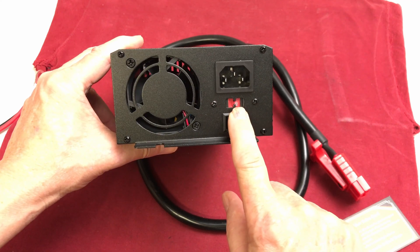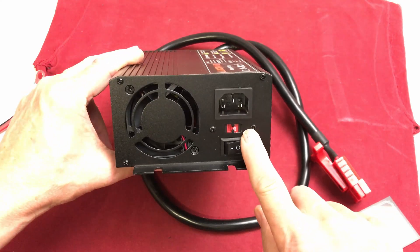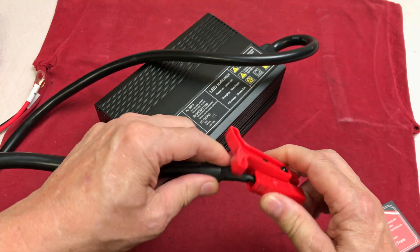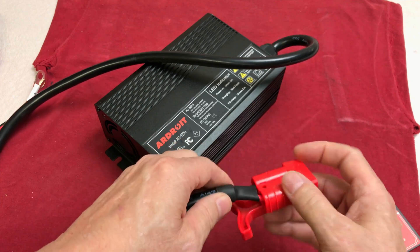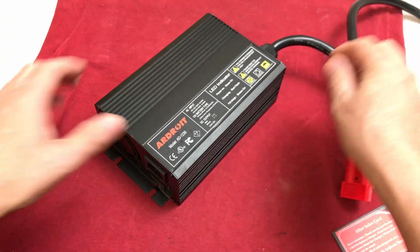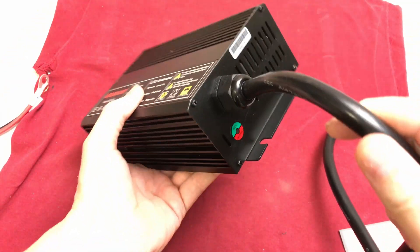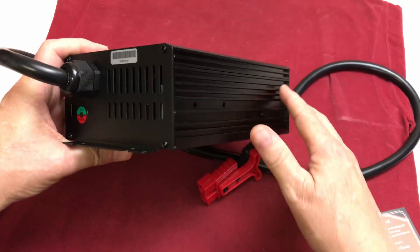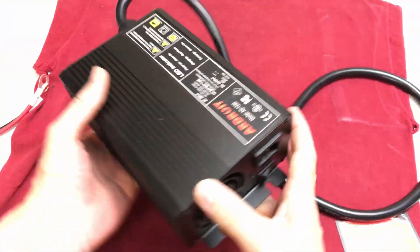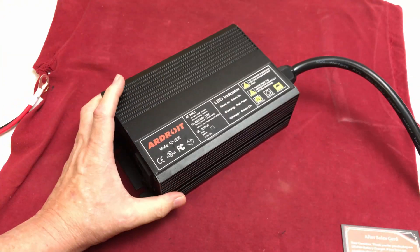On this side there's an on/off power switch, a pretty large cooling fan — you'd need good airflow for a 30 amp charger. There's a voltage selector to go from 110 to 220, currently set on 110. The power cord wires appear to be about 10 gauge, which would be fine for a 30 amp charger with an Anderson connector. The LED light on this end will be either red or green depending on where it is in the charge sequence. Only one side of the box has the cooling fan, which is offset — that must be where all the MOSFETs are. The case is aluminum, so the entire case acts as a heat sink.